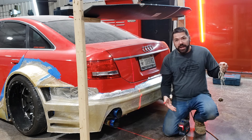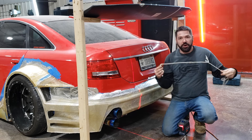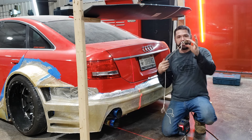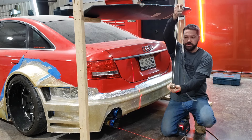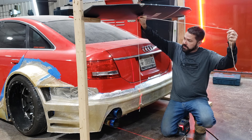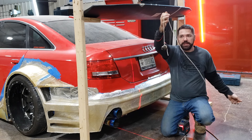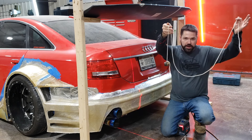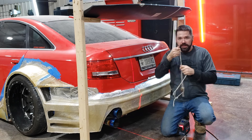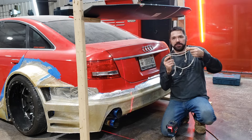As you can see, I have a laser level which can also show plumb — the vertical line. But if you don't have that, there's a simple way: you can use a plumb bob, or if you don't have a plumb bob, you can make your own with just some kind of weight and a piece of string. Here you can see a piece of string with a couple of nuts attached to the bottom for weight — that gives you the exact same vertical line. Anything heavy tied to the bottom of a string will still give you that plumb vertical line, so if you don't have an expensive laser machine, there's still a cheap and easy way to do this.